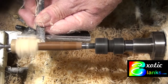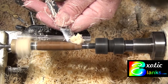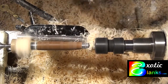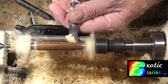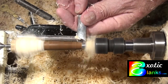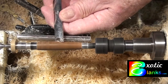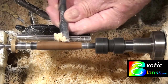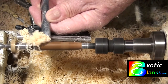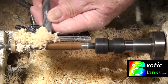We start out here seeing the bottom, the body of the pen being turned. The body of the pen is relatively simple. We drilled it with an O or an 8mm bit, and then we put a brass tube in it and allowed it to cure over a couple of days. What I'm using here is Alternate Briar. It's one of my favorite materials, but it's been a long time since I've turned it, so it was kind of fun just to get back to turning something that has a little bit of challenge to it. This is not the easiest material in the world — not real difficult, but if you start getting ribbons off, everything is cool. Just pay attention to what you're doing.